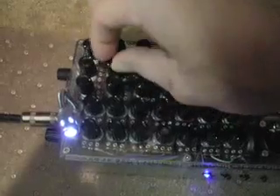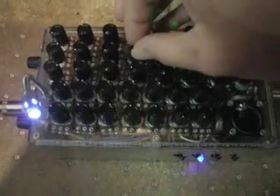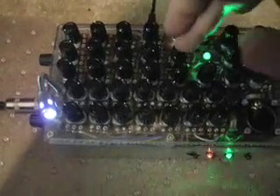This next one here is a mix knob for oscillator number one for ring modulation, but we'll get to that later. This one's for LFO depth. This LED here shows the LFO blinking — you can hear the amplifier turn on and off or get louder and quieter. This knob is the output level of the VCA, which determines how loud a signal goes into the filter.